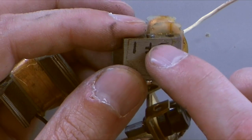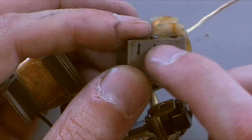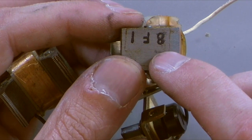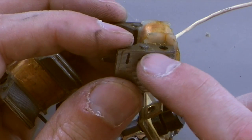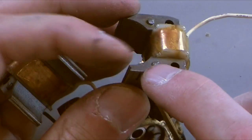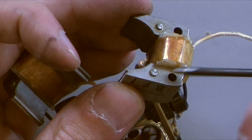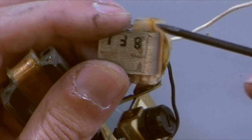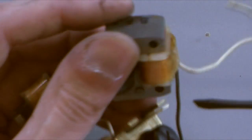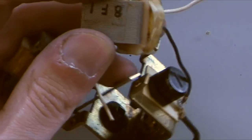And by doing it out of laminations, they just start with a sheet of that metal, and they stamp them all right out. So they can get any complex shape they want, like this, out of little thin metal and stack them up, and then they just put a rivet. You can see the rivet right here. That's a rivet, and so is that. And just stamp them on there. And then they put the coil bobbin on and wind the coil. So that's how they make the electromagnets.